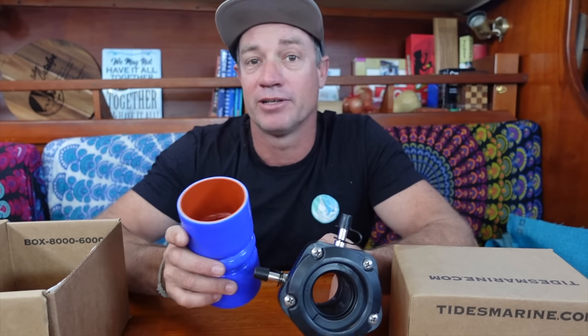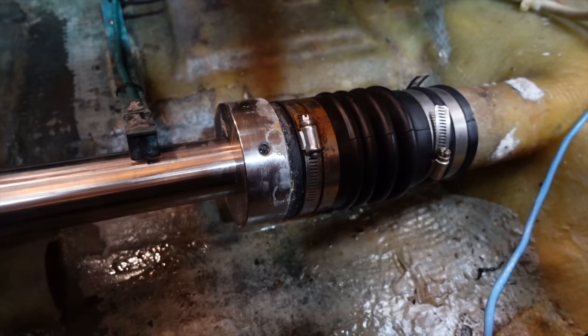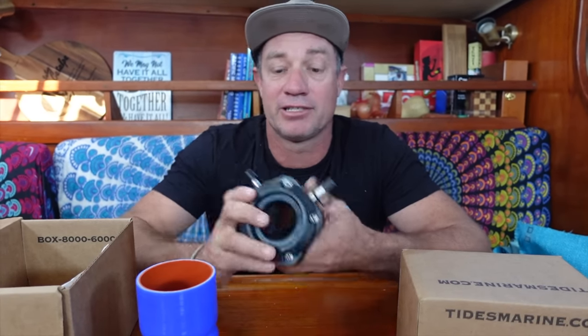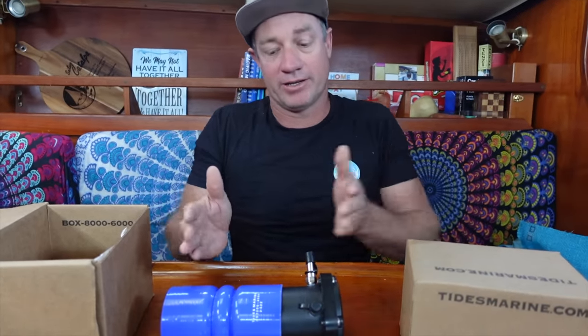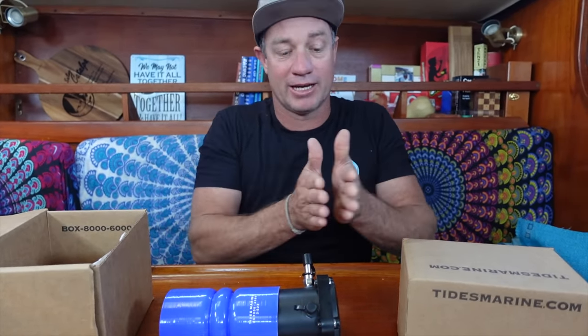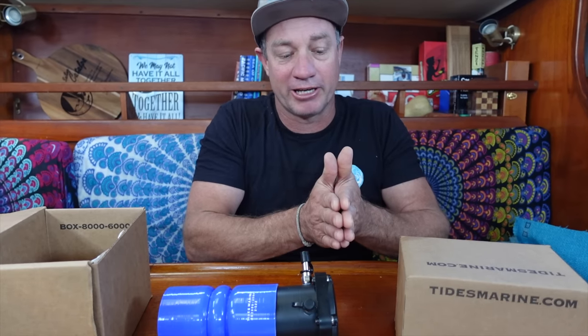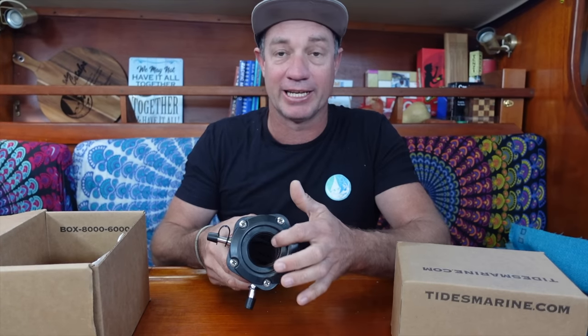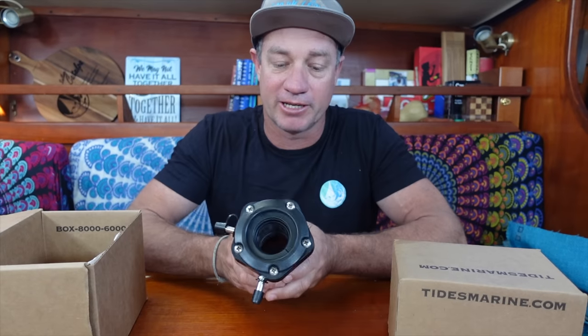It's a little bit different to the one that's on the boat. The one on the boat is very common — it's a PSS valve, very well known in the industry. I personally don't like it; I really like this one. It's a completely different setup to the PSS. The PSS valve has a flexible bellow — it relies on the bellow for pressure onto a carbon graphite flange, and that's where it gets its seal. So it's like a face seal. This is a lip seal, similar to an engine seal.